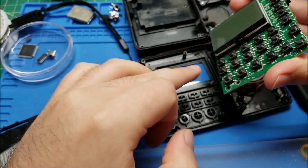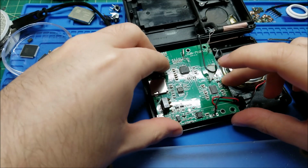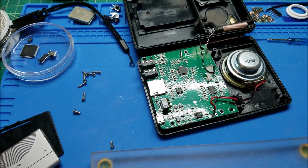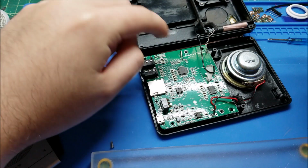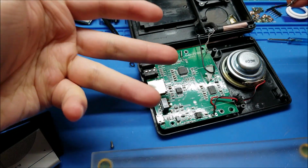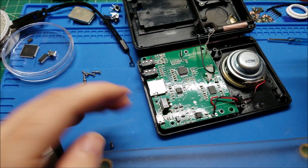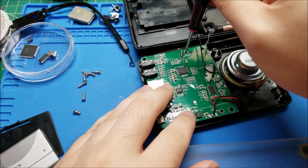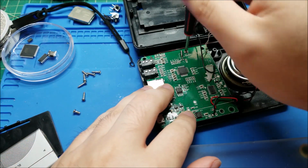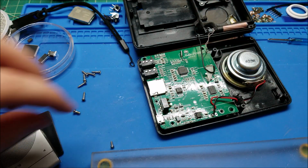Looking at an angle, I can't really see anything underneath the screen. I don't think there really is any circuitry. I just see a single wire soldered from the screen. So yeah, anyway, let's speed reassemble everything together. I do just want to note, I also forgot the main crystal for the oscillator. But the circuitry is laid out really well. The soldering's good. I don't see any issue with the assembly or anything like that. So this looks like it was designed properly, and some good thought was put into functionality versus what components should be used.